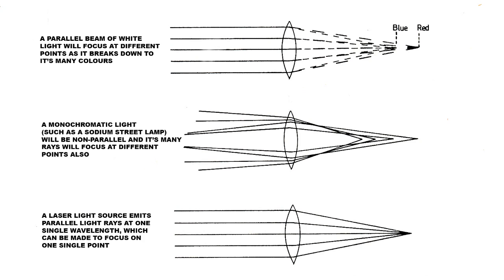If the light arrives at the lens parallel and is only composed of one wavelength, then as it passes through the lens it will focus down to a single point. Now the CO2 laser has exactly those properties. It emits its power and light in what they call the infrared spectrum — around about 10 micrometers wavelength, which is about a third of the thickness of a human hair — and the energy is totally invisible. You can't see infrared heat but you can feel it. If you put your hand out in front of a fire, you'll feel the infrared heat. That's basically what's happening here, and then we take that heat and focus it down to a single point.